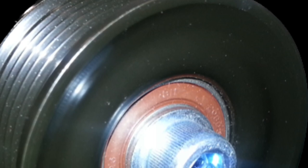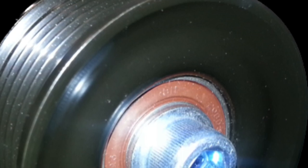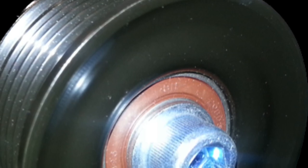As far as pulleys on the engine, there's an idler pulley on the top of the engine towards the back for the serpentine belt. If it says Viking on it, or it is an aluminum pulley, meaning a magnet won't stick to it, it has been grounded through a service bulletin years ago, and a Gates pulley made of steel replaces it. Install it with the proper bolt and spacer so it is aligned with the other pulleys.